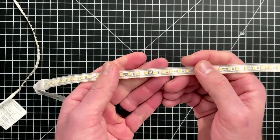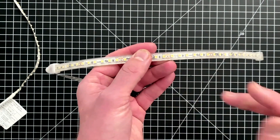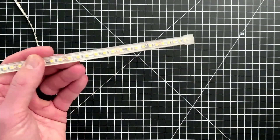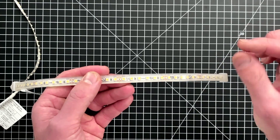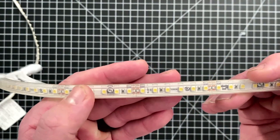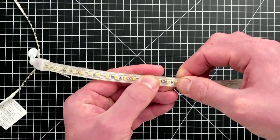We have our tape light fully encased in a silicone sheath. We worked with UL on this and we're one of the only tape light manufacturers where you can cut the wet-located tape light in-field and keep the UL listing. A lot of contractors will say they do that all the time, but if you look on the fifth page of a competitor's spec sheet in small writing, it will say cutting in-field voids the UL listing. With ours, you look for the cut point, cut it there, take the end cap, put a little silicone in it, pop it on, apply pressure, let it seal, and you're good to go.